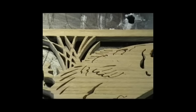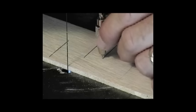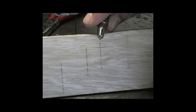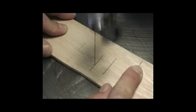Now, if you have longer veins in areas on the wood by themselves to make, you might be at a loss as to how to deal with it. This is where the small drill bits and a twist drill will really shine. Try drilling your veining at the beginning of a line, at the area you know will have a waste area or some other relative point to the other veining holes.